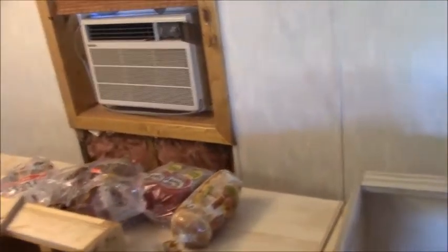Now what I need to do first is wiring. I need to figure out how those wires come to that outlet that's going to be buried and move it up above this end of the cabinet. We'd really like to put one on each end just in case you're running a crock pot or something, but it doesn't really need to be. We have our water cooler here, so I'm going to be able to knock a hole through as far as this stud. So I'm going to drill an angle hole and get my outlet over there on the end to plug that into.